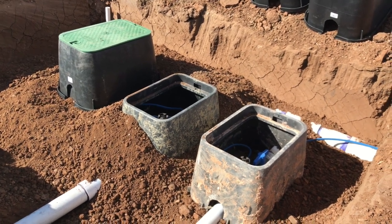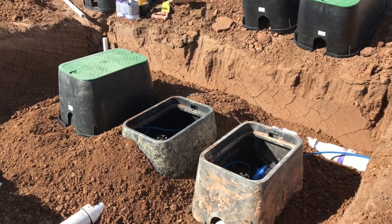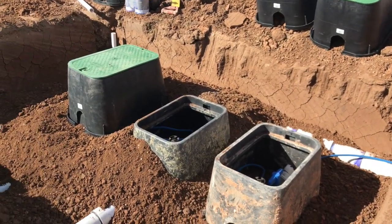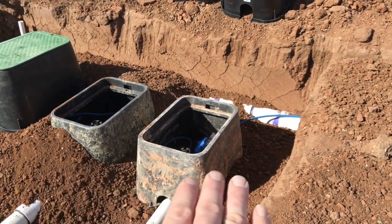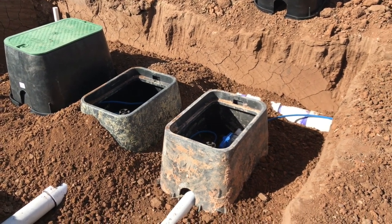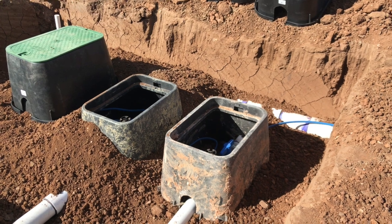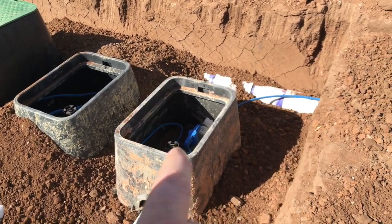One of the things that I like to do, for several different reasons that I started doing — all this right here is actually pretty deep, deeper than one valve box. So if I put one valve box over this valve, it's going to be too deep. Now, one of the ways that we used to do it, and I've seen guys do it, is you just fill it full of dirt and put the valve box over it so it's level, but it fills too much dirt around the valve — you can see it in there.